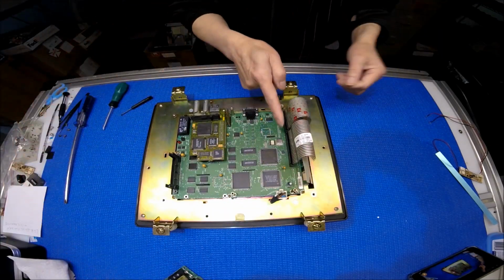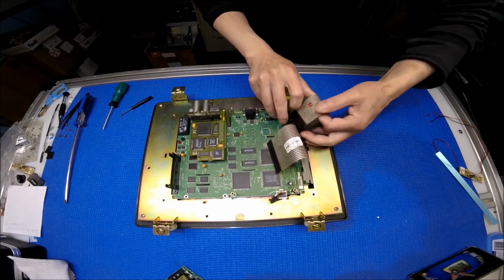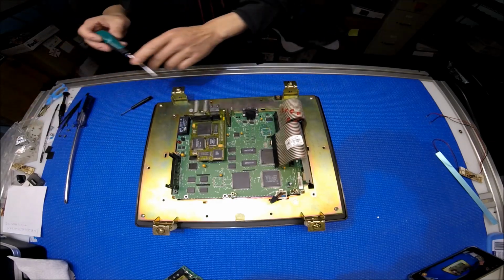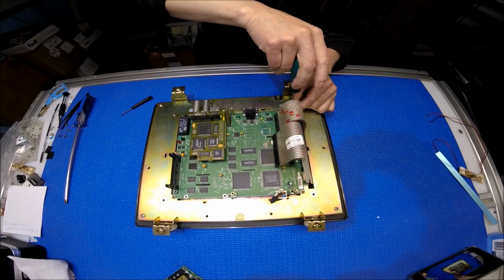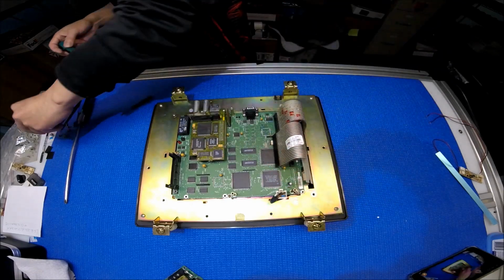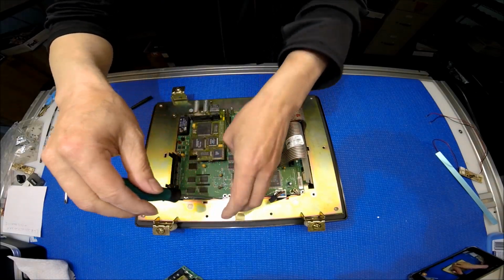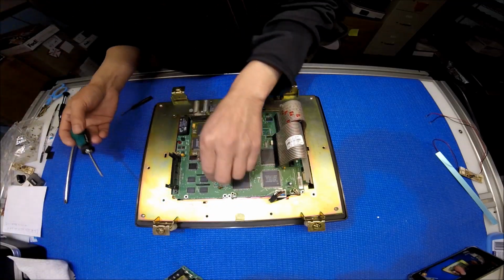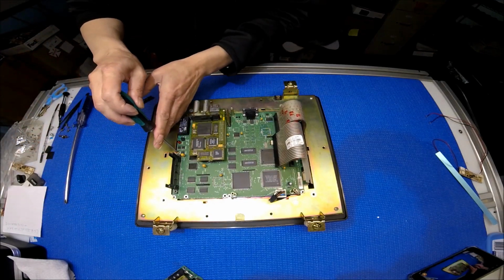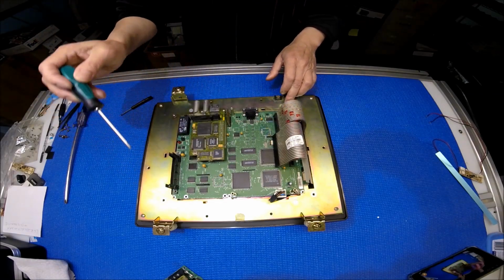See this pin, right? This is a touch screen because the screen is right there, so we need to remove this one too. We just remove it. Take the charger out. There are a few screws holding this main board. Oops, here's where the screw goes. Right here. One more, or 2 more. One is here. 1, 2, 3, 4, 5, 6, 7. Seven screws actually.